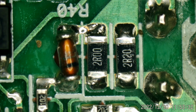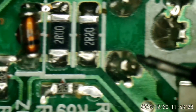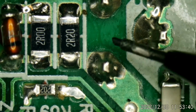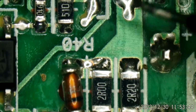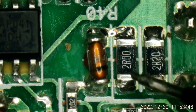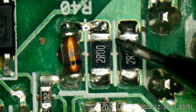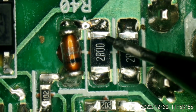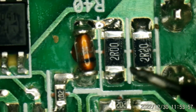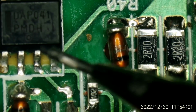All right, now that we're looking under the microscope, we can see those two resistors. Here's the MOSFET, there's the source, there's the two resistors, and that's their return path to ground. So we get a voltage developed across these two resistors. It should be about a 1 ohm resistance, but we're reading about 1/10 of an ohm, or 0 ohms, something like that. And you can see the Zener here that's supposed to limit that voltage, so it limits what hits this IC over here.